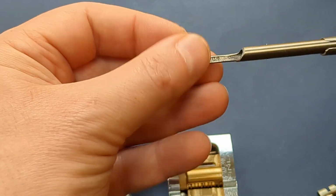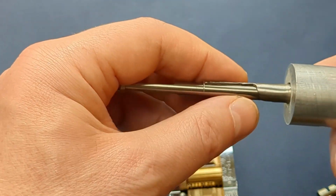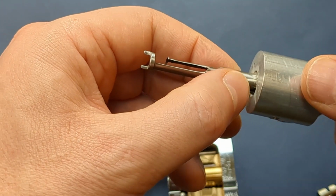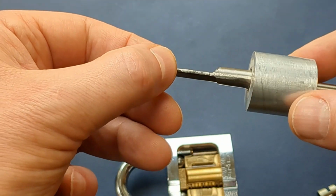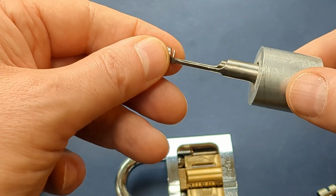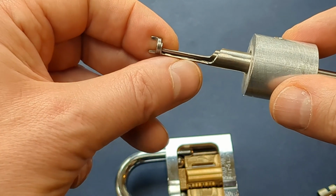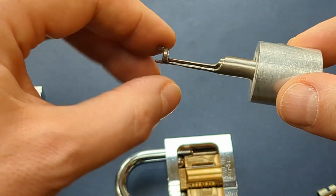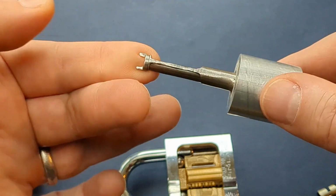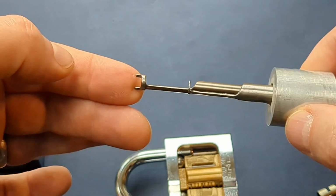So this design here, this is made from a 6mm tube, and the pick here started out as a 10mm spring steel roll pin, which I've ground down quite a lot to get it into a 7mm keyway. So this is less than a millimetre thick now, top to bottom. That took quite a lot of work, and is maybe not the best in the end, it's a little bit bendy, but it does work.